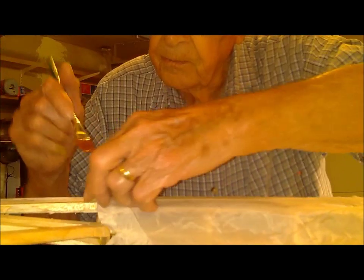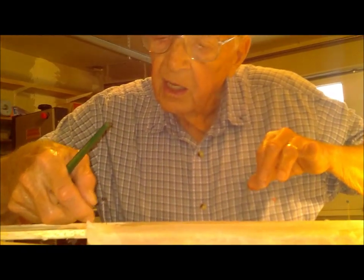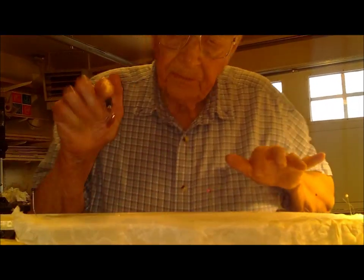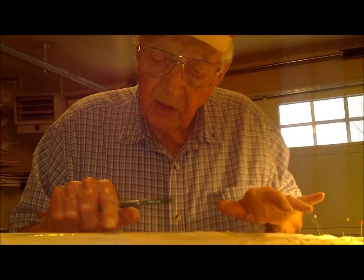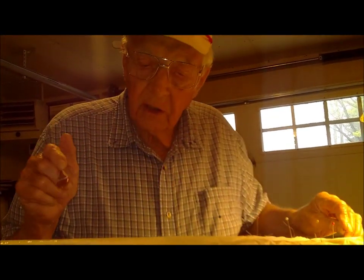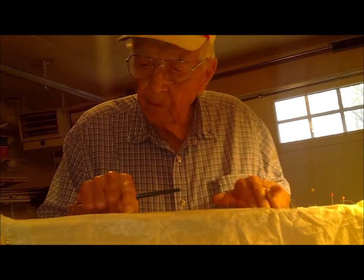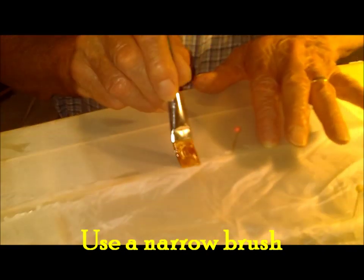Run your fingers over there. You can use gloves for this, but on nitrate dope I usually use my bare fingers. It's probably okay to use rubber gloves, but I've been doing it for many years without rubber gloves and nothing ever happened to me. Use a narrow brush to just get it on the seams.